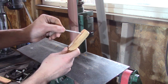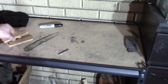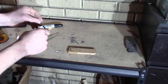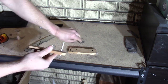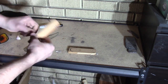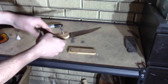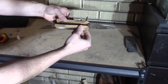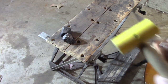I make sure the part sticking out gets hammered in so it doesn't have a tapered look. Right now I'm just doing a test fit — I want to make sure the pins go in. The worst thing is when you're going to attach the handle, you have the epoxy on, and then you find the pins don't fit. Doing this test fit also helps with shaping the handle while the pins are in.